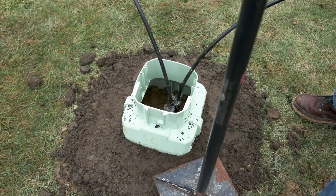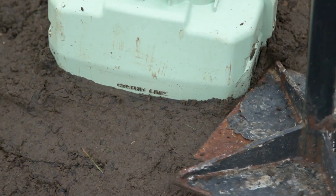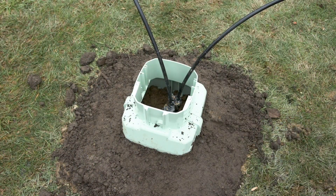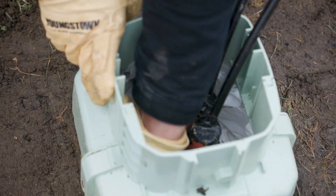The backfill in the trench outside the base should be level or above the ground line located on the base. Never mound backfill soil on the outside of the base to make it appear that the base is installed to the recommended depth. If you need to straighten the pedestal at any future time, never attempt to straighten by pulling, pushing, or manipulating the dome. Remove the soil from around the base and readjust the base to replumb and straighten the pedestal. Follow your company's standard practices prior to readjusting an installed pedestal. Once backfill is at the proper level, install the moisture barrier. The shrink wrap used to package the pedestal can be used as a moisture barrier.